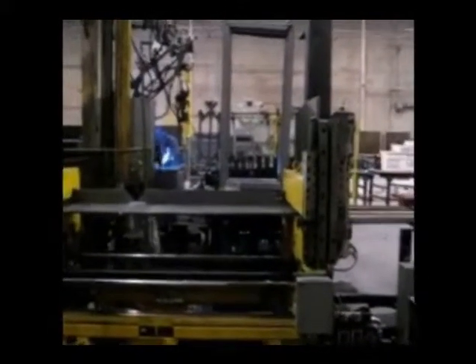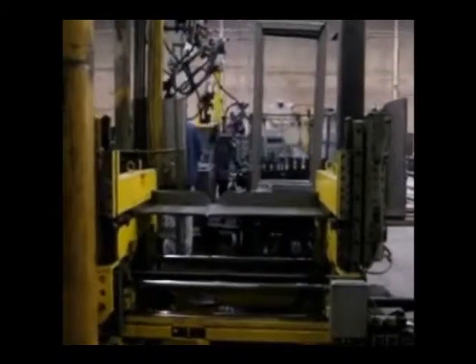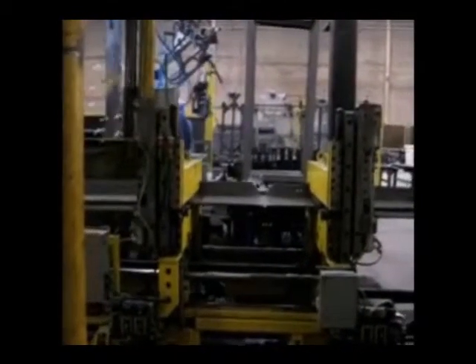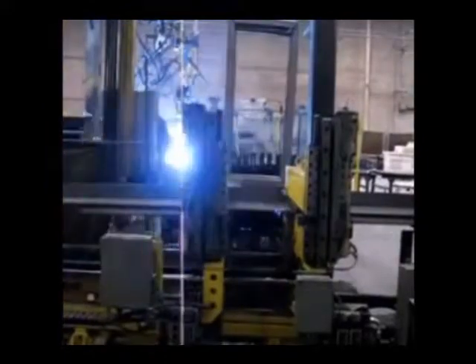The system can produce an 18 by 24 inch cabinet and then a 36 by 72 inch cabinet, or any combination within the same coil width or cabinet depth. The notch dies and roll form tooling are set up for a quick changeover when changing between gauges 10, 11, or 12, and to change the coil width or cabinet depth.